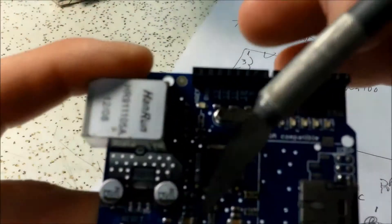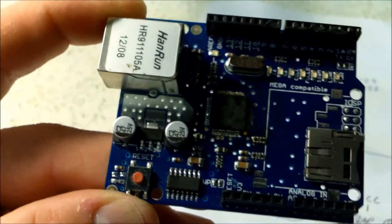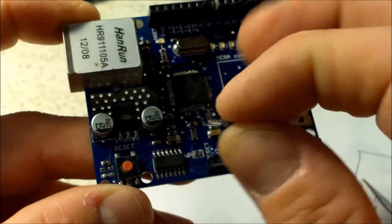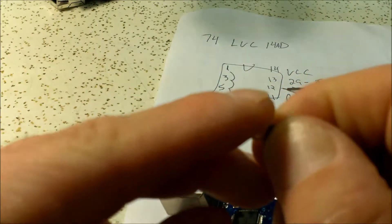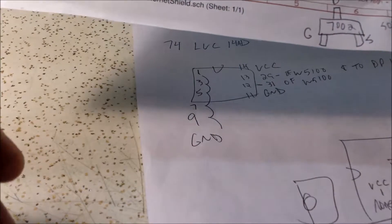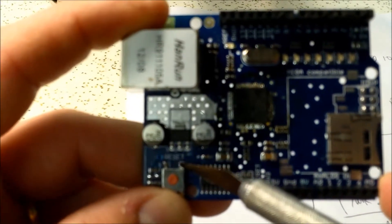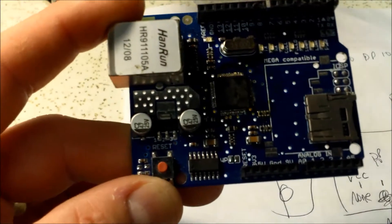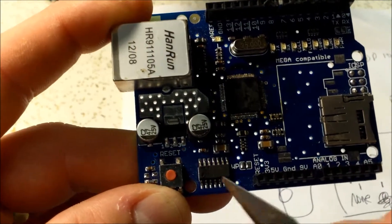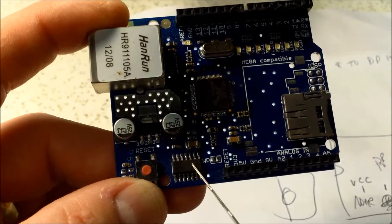You need to be concerned with pin 14, pin 13, pin 12, and pin 11. Once you take the buffer chip off, you can take the little transistor, stick it on there, and solder the two pins to pin 12 and 13. What I did was take the source leg - which goes to ground - bend it around and use a nearby ground point, just put a little dab of solder there. Use pins 12 and 13 and that's it - it works great. No cutting of wires or traces. If you have a rework station you can put the buffer chip back on afterward if you want.